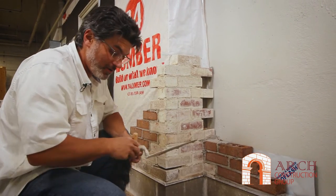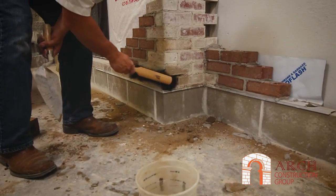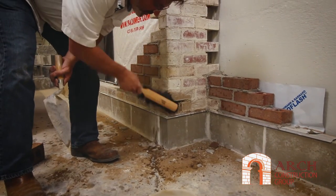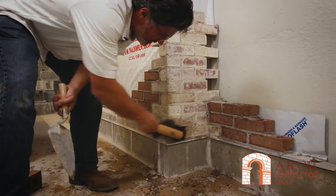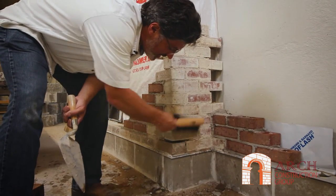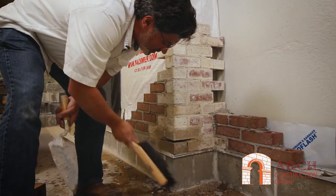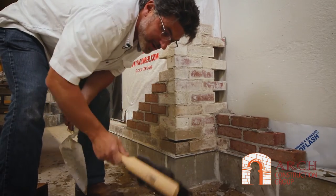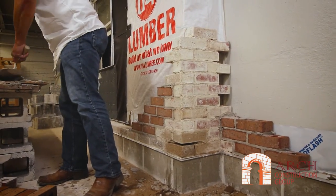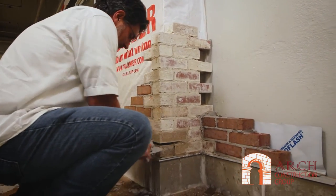You have a little spray bottle — that's great. If not, get a bucket of water on the job site, dip the tip of your trowel or something in there and dampen it. This mortar will set up super quick when you point this hole — too quick. It'll stand out like a sore thumb; it'll be a different color and you might not achieve the proper strength. So always wet the corner pull hole before you strike it in.